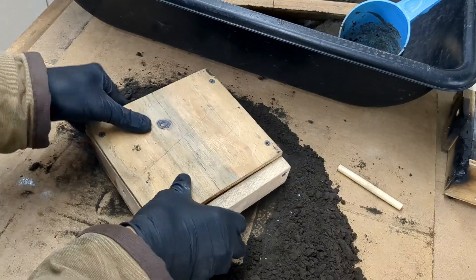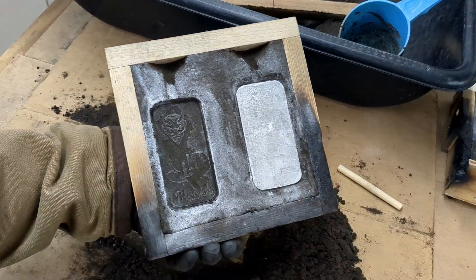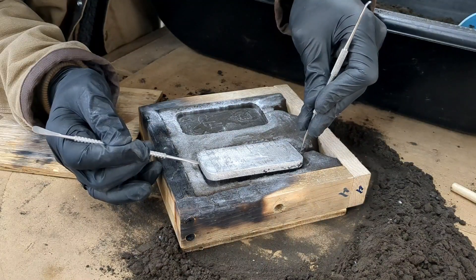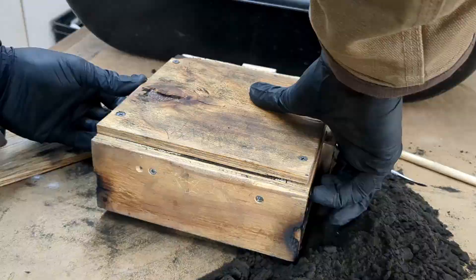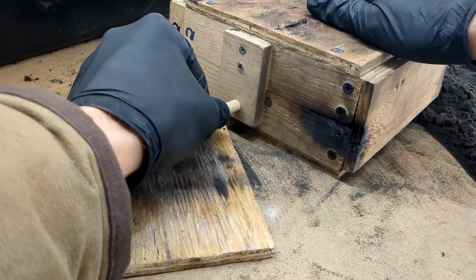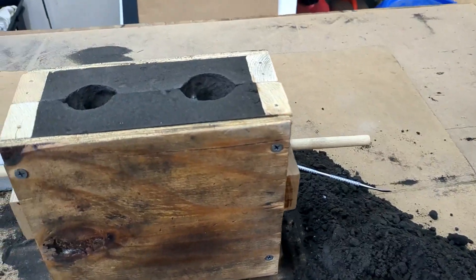I'm putting a flat surface on it and I'm going to flip it and give it a little tap and pull upward, hoping that they both came out. Unfortunately only one of them came out, but the pattern still looks like it came out really well. I'm going to tap on the other one a little further and just pick it out gently. Now that that's complete, add the other half of the mold box back and place the locking pins in place.